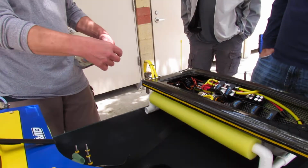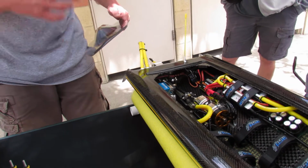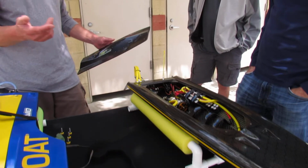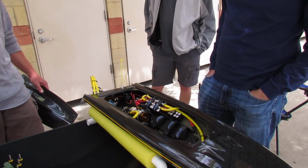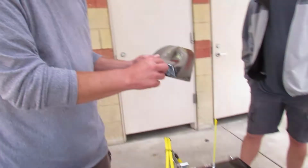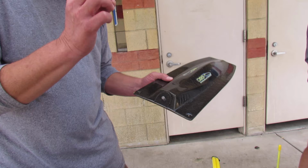As you know, it goes right through the high-speed steel, wears them down really quick. But what's really cool, I work for a company that makes special tooling for carbon fiber materials, and I have a sample kit of these tools, and it's all synthetic diamond tip drills. For example, I had to drill this hole to put this little guy in. I had this little drill, and it was the perfect size.